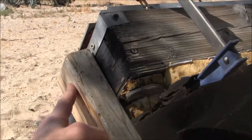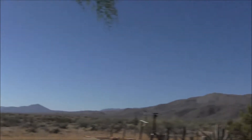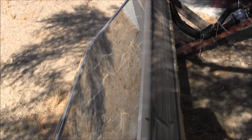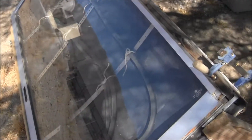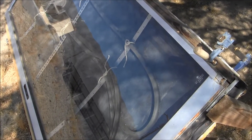The legs are adjustable with just one screw. Here in Southern California, the sun rises much lower in the winter, so you want a steeper angle. Right now it's May and I have a steep angle since I don't really need to heat at this point. I run it off a timer that turns on in the winter whenever the sun is fully on this window and turns off before the sun leaves.